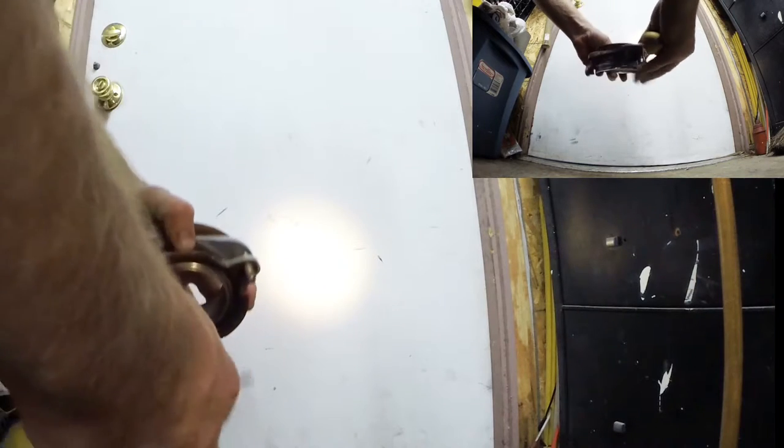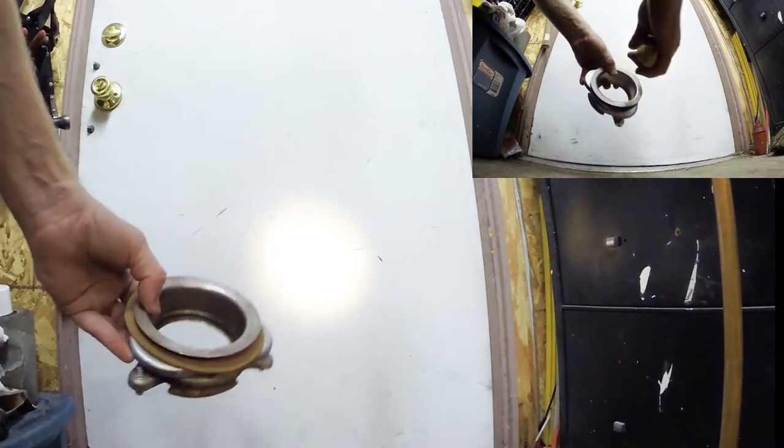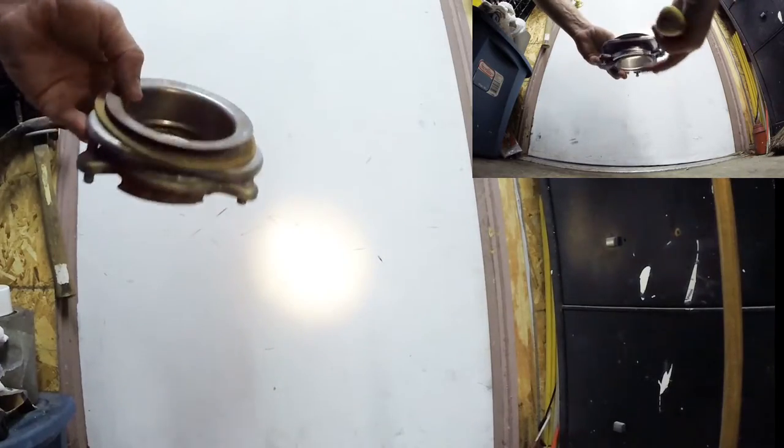And then what you do is tighten up your screws here, flat blade screwdriver, all three of them all the way around, tighten them up. That's going to squeeze out a lot of your plumber's putty from the top of the sink, and then you're just going to remove the excess plumber's putty.